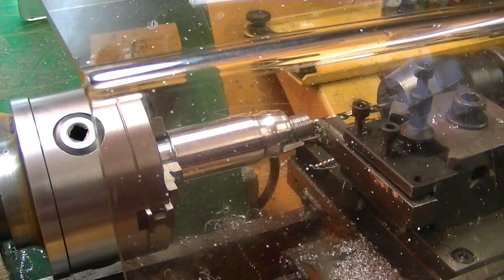Welcome to a short video on the MQ5 compact CNC lathe. We've just done a small program called 'Two Tour One.' At the end of the shaft that's been turned, we're now going to drill a 4.2mm hole, then put a 6mm drill in for 10mm depth, and then bore it out.